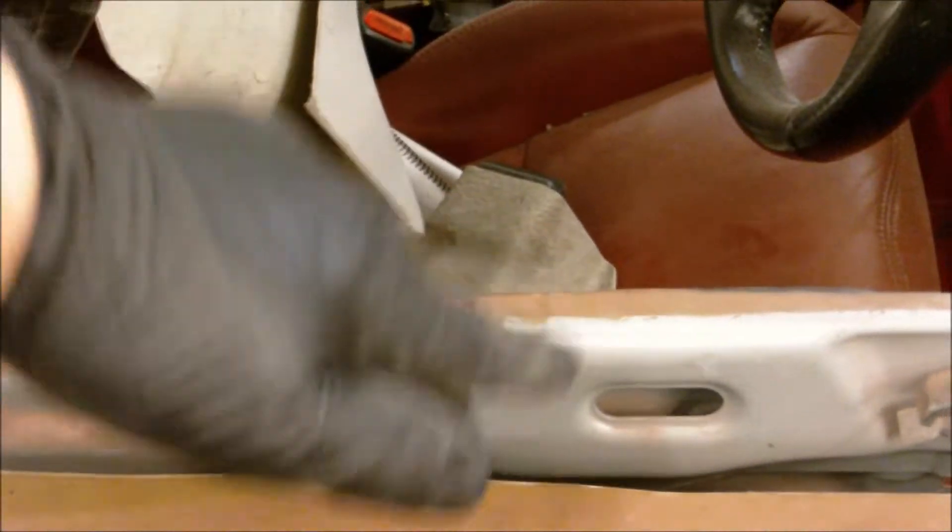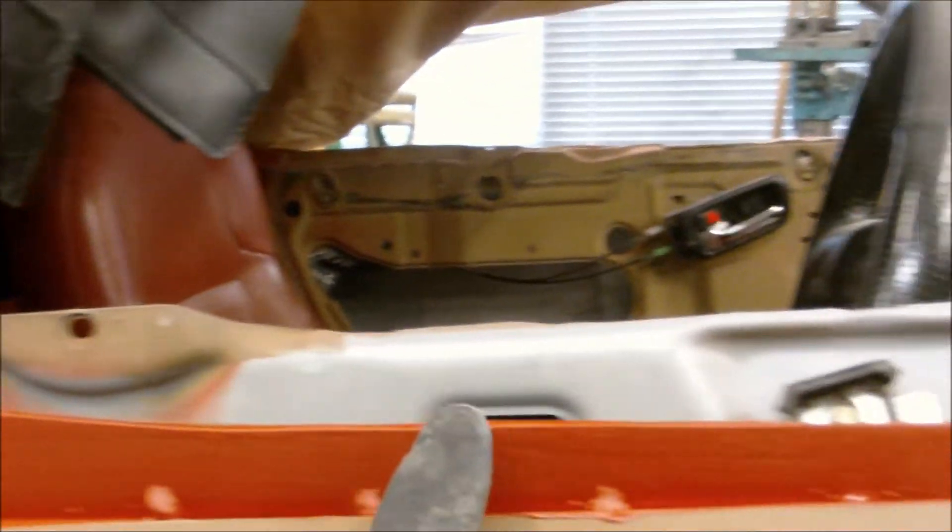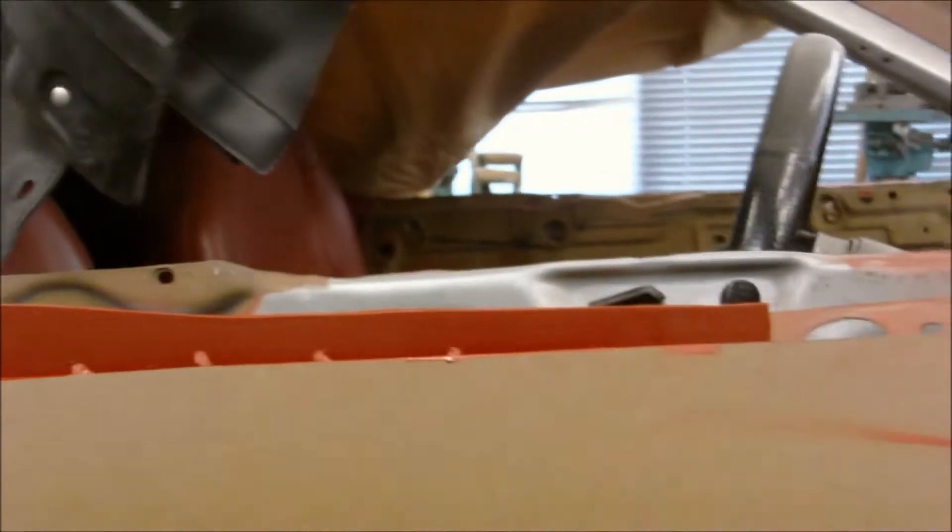This is what I mentioned about three years ago with the fiberglass door — you can bend it, so if someone's leaning over it, it just sags. So I've got some little reinforcing bars or plates, and they literally follow the profile of the fiberglass door within about three mil. All the way along the top I'm going to put a bead of sealer or adhesive, and that will hold the door structurally sound at the top as well as the sides.